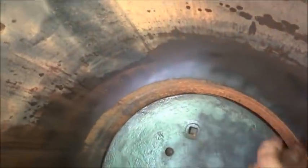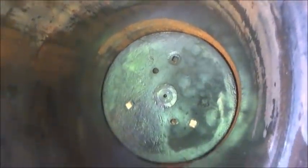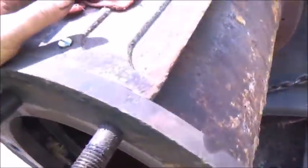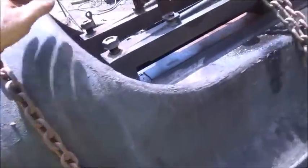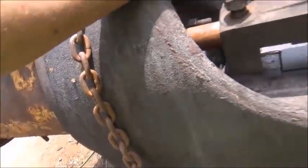We're seeing a little bit of dry. Don't feel bad though. A little bit of surface rust. We're gonna get that piston all the way to the bottom and then we're gonna oil it up again. I can't get anything into the bottom unless I pull the cylinder off, and I'm trying to keep from doing that. But it's not turning hard, so I'm not real worried about it.